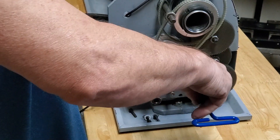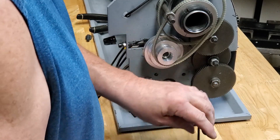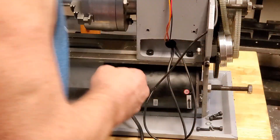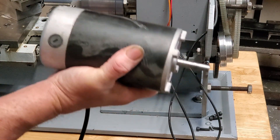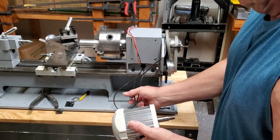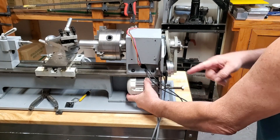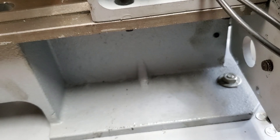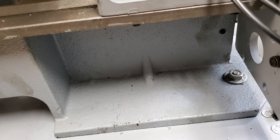The last one you're going to have to hold the motor up and down a little bit. Pull the motor out in the back. It is a little bigger — or heavier maybe. Check the motor to see if it fits in the space. Look at this end to see if you're going to line up the bolts. This one feels like it'll fit, but there is that little black bolt coming through from the other side — I'm going to have to pull that out and grind it so it's not sticking through in the way.